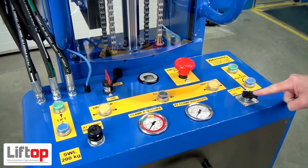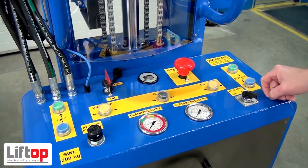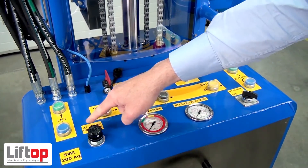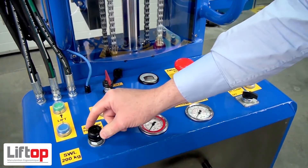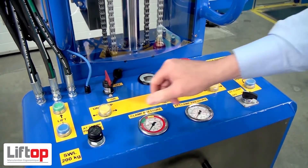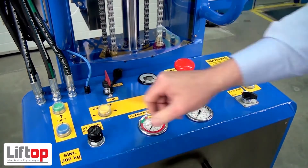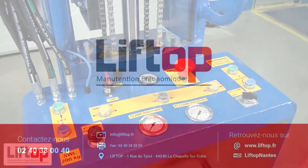The next control is the anti-telescope clamp. This is the clamping pad we looked at — we can either switch it on or switch it off. This one here is the pressure reducer, which lets us set the anti-telescope clamp pressure. When we turn this, it affects the needle on the gauge. Turn it down and it will clamp at less pressure; turn it up and it will clamp at more pressure. It's fairly complex, but easy once you get the hang of it.